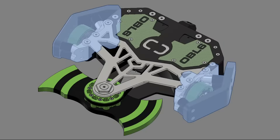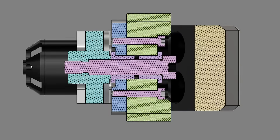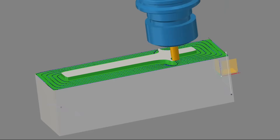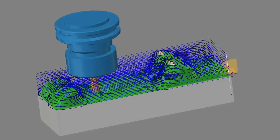Each side of the robot features a drive pod that is completely interchangeable on each side, meaning one spare unit will fit either if something fails. The wheels have bushings that ride on a smooth shoulder bolt axle — off-the-shelf parts that are easy to stock up on. All of this, including the shock-mounted armour, affixes to the most complex part in the design: a large block of aluminium with mounting features all over for the frame, wheel, motor, and armour. The angled features will be quite a challenge for me to manufacture on a 3-axis mill, and I'm yet to come up with a plan on how to drill those armour mounting holes accurately.